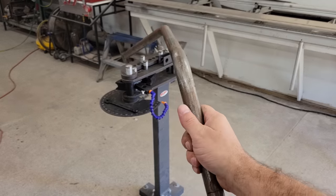So that's it for building the chassis. I'll be adding a few more mounting brackets for the seat and the fairing when the time comes, but it's finished for the most part. I'm happy with how it turned out — the jig made it really easy to establish reference points and keep everything lined up perfectly. Some of my welds could look a little better, but overall it's a really strong design. I love how much lighter it is than the old chassis — 20 pounds is a significant difference. A trellis frame involves a lot more manual labor compared to more common die cast aluminum perimeter frames, which is why most production bikes don't have them, but it's worth the effort, which is why some of the best production bikes do have them.